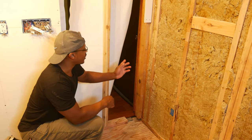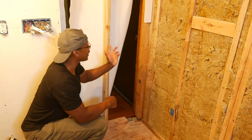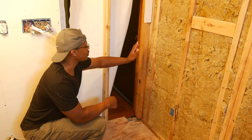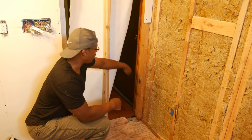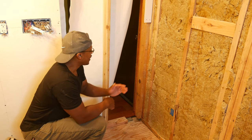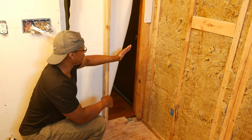The other concern is that when I go to put the door up in this doorway later on, if I don't make sure this is nice and plumb or even close to plumb, I could have some really serious problems trying to get the door in and have the jamb not stick out into the opening or kick back that way. So as you can tell by the measurements, this wall is kicked back this way, and I really need to kick it the other way.